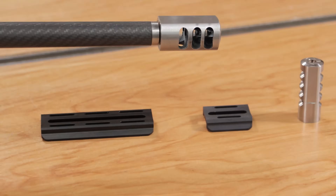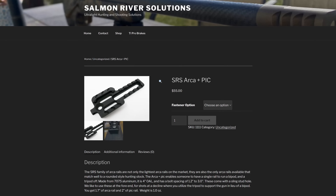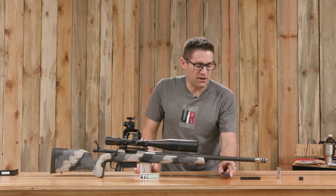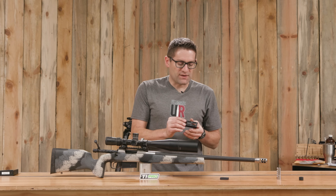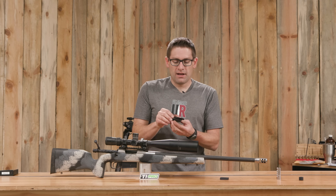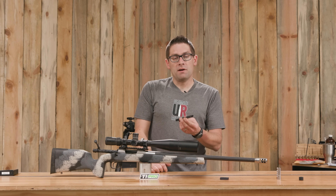They also have a bunch of rails. They have a unique offering — Salmon River Solutions is the only company to offer a combo Arca and Picatinny rail. So if you have two different types of accessories like bipods and you want the option to run Arca or Picatinny, great solution. What I have here is their mini Arca rail — this is the 4-inch rail, the one I'm going to install on the rifle. It's got a beveled contour that's going to fit the bottom of the stock for a direct mount, but I'm going to take this over to the milling machine and mill a flat area and use the outer rail areas. If you're going on the bottom of a chassis, it'll mount right up; if you've got a hunting rifle, you can install it with no machining.